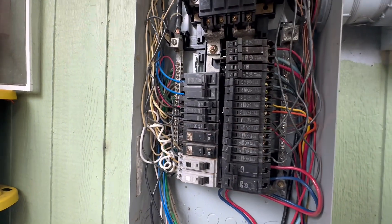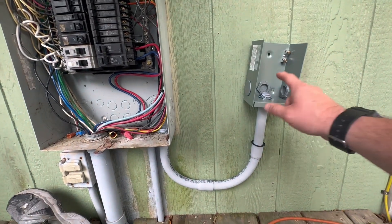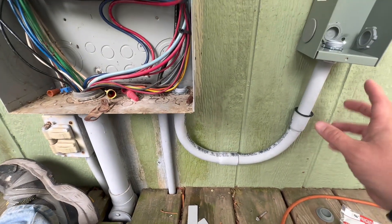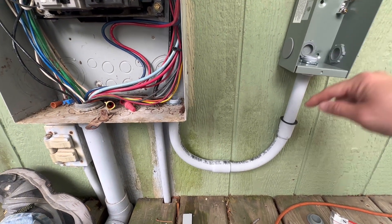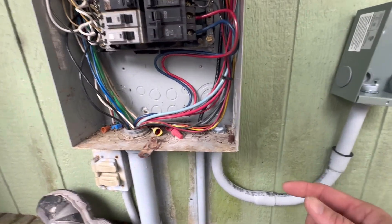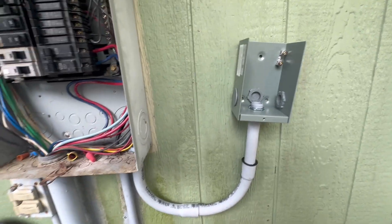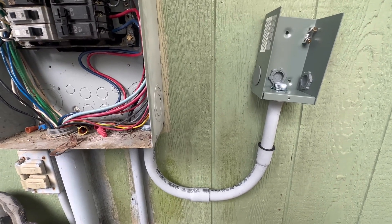The circuit is dead and there's no power to the smart meter, but make sure everything is off. I've got the box and some three-quarter inch conduit from Lowe's. I'm going to feed the four strands of wire through the conduit up into the 200 amp breaker box, with my 50 amp breaker stationed right at the top. This is all put together with items available at Home Depot, Lowe's, or any regular hardware store.